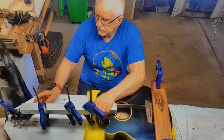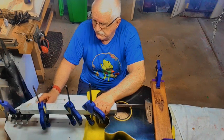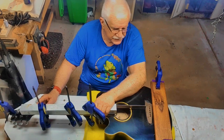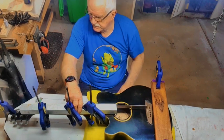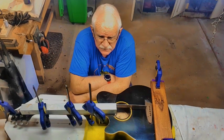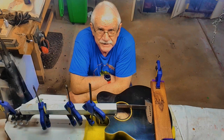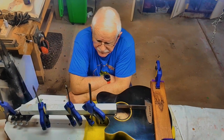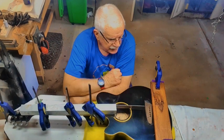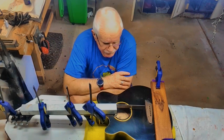And that's basically all there is to it. I've taken the nut out — you don't have to, but I just find it easier. Actually, I'd say: take the nut out, it's no biggie. Obviously the bridge pins and saddle are out too. Leave it for probably a couple of weeks — three weeks if you can, but a couple should do it. Every now and again, after your first week, take your clamps off, measure it, see how it's looking, then clamp it up again and give it another steam. Leave your packing in the body. And that's it.